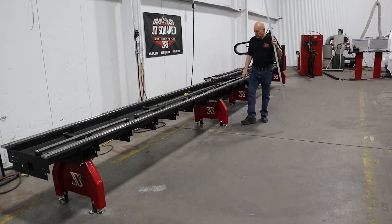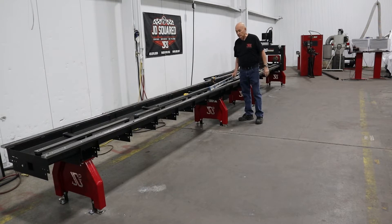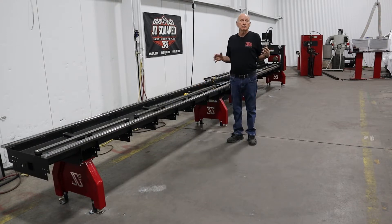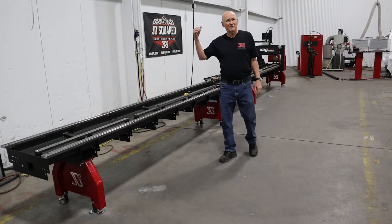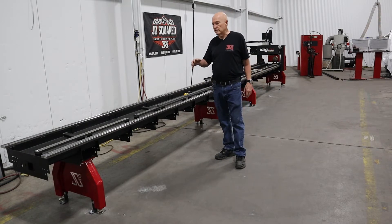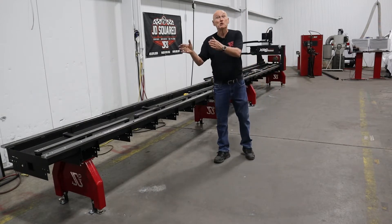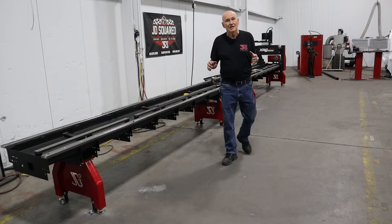After that, I made sure the legs were slightly unloaded off the ground, which is what we wanted, so I snugged them up a little bit as explained in the first video. Then I used my level to make sure everything looked good. You don't have to have it perfect — on a 24-foot machine with 240+ inches of travel, being off half a millimeter on one end won't show in your cuts. But get it as close as humanly possible, because why not.